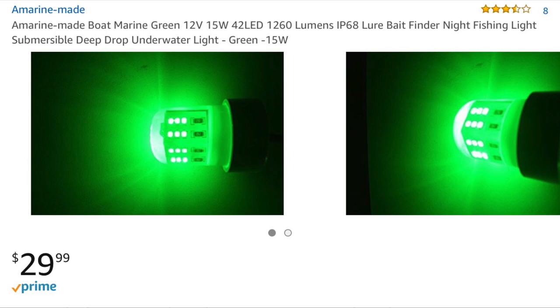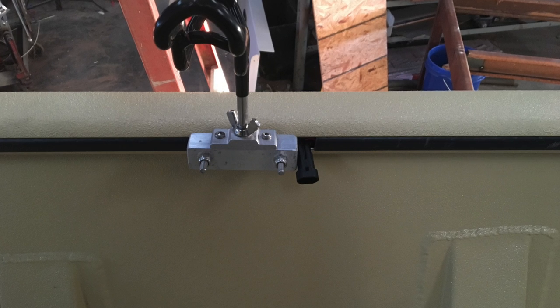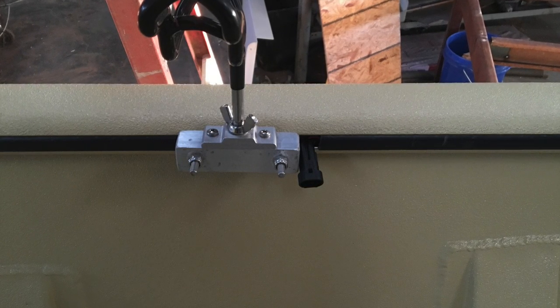Briefly, let's talk about gear. I use a marine-made 15-watt green submergible light purchased from Amazon. They make 3 sizes, and I've found the smaller, cheaper version puts out a blinding amount of light and draws a fraction of the amps compared to the bigger versions. The middle and bigger versions put out more light, but they don't seem to light up the water any more than the smaller one does, and they draw 4 or 5 times the amps. Color of light is a debated topic, but the general consensus is that green and white lights work best in freshwater, and blue lights work best in saltwater. If you get into night fishing, you may want to consider rigging your boat with electrical quick connects — in my boat I have them in the cap rail system every 4 feet, so all my submergible lights can be turned on with one toggle switch, avoiding tripping over wires in the middle of the night.